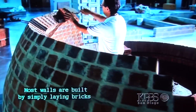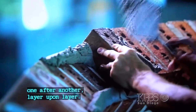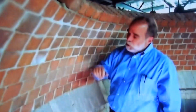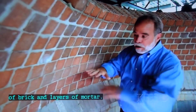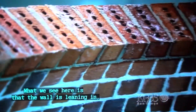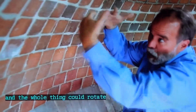Most walls are built by simply laying bricks along straight lines, one after another, layer upon layer. Russell Gentry, a professor of engineering at Georgia Tech who has studied Brunelleschi's methods, explains: if Brunelleschi had built the wall in the simple way, layers of brick and mortar are separated by one another, and those mortar layers represent planes of weakness. With the wall leaning inward and gravity pulling, a crack could form in a mortar layer — the mortar is weaker than the brick — and the whole section could rotate and fall in.